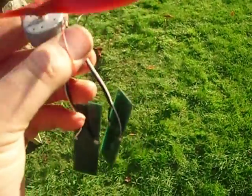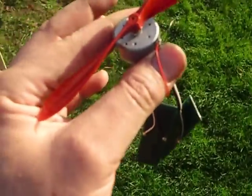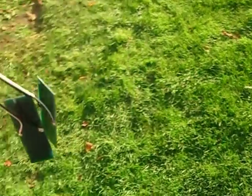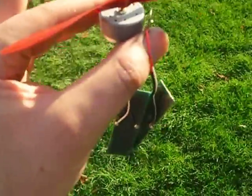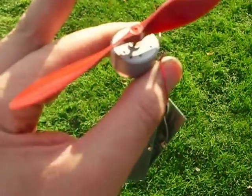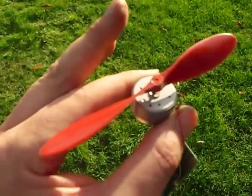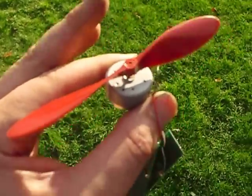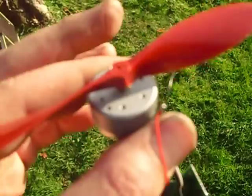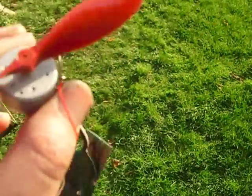So it's a switch — let me hold this. You see, that's a nice switch. Click click click click, and then in the middle there's nothing, the switches undo — click click click. The sun moves around a bit — click click. So you can use that motor to operate switches, and those switches will operate a much more powerful motor which drives directly off the main solar panel. That's actually a more efficient way of doing it.